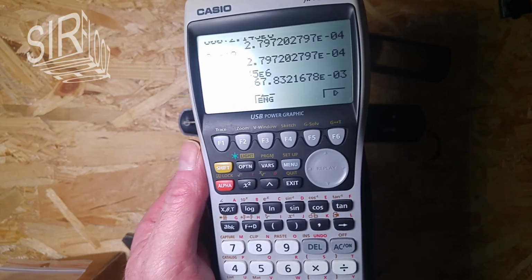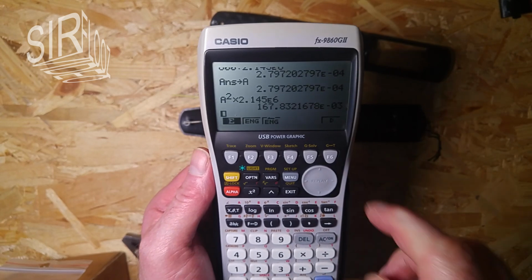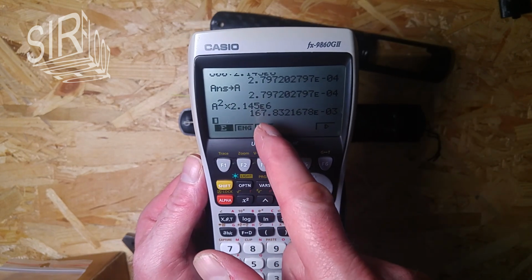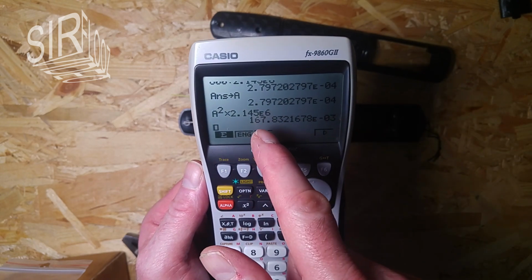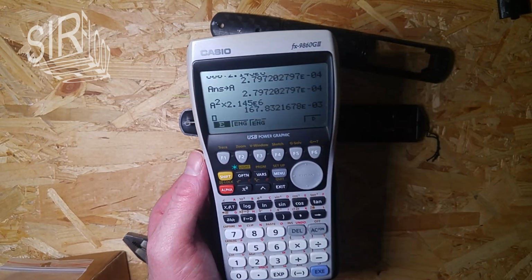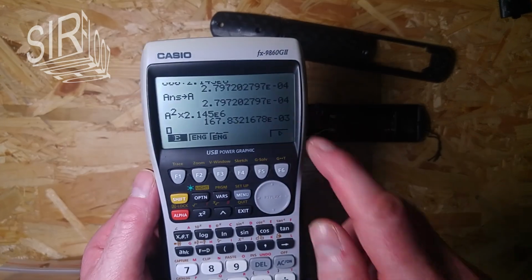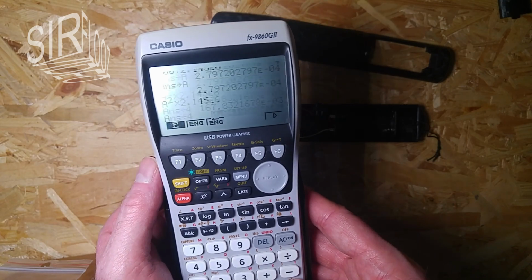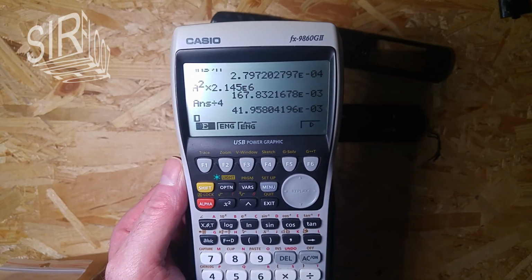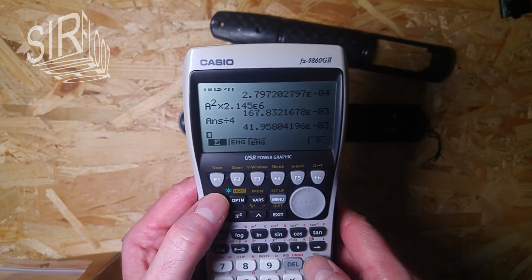And there's also the power rating, and I calculated with 600 volts. If I just connect one resistor to 600 volts, I have a power loss on the resistor of about 170 milliwatts. That's okay, because the resistors are rated for 200 milliwatts. And if I use, for example, 4 resistors, it is just 42 milliwatts per resistor, and that should be fine. The resistors shouldn't sweat too much there, and at least get lukewarm.